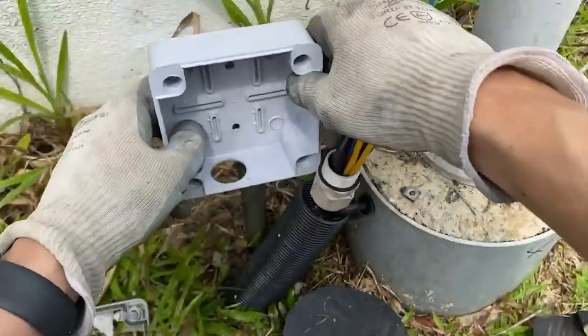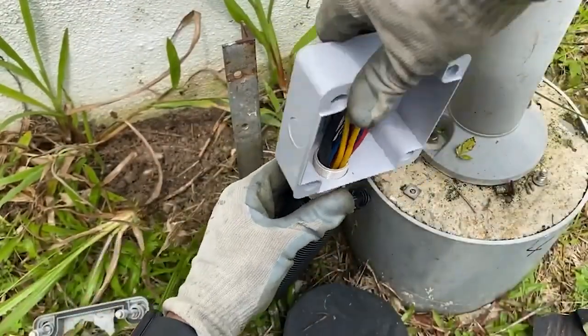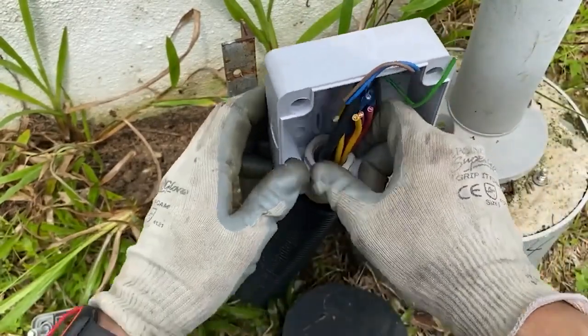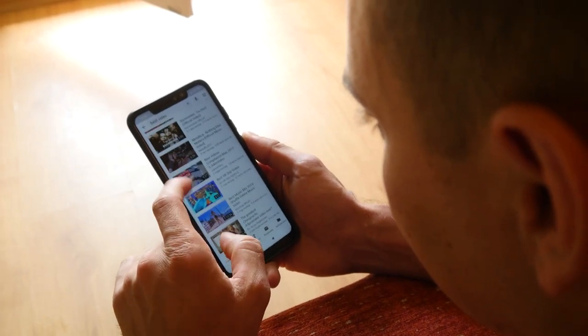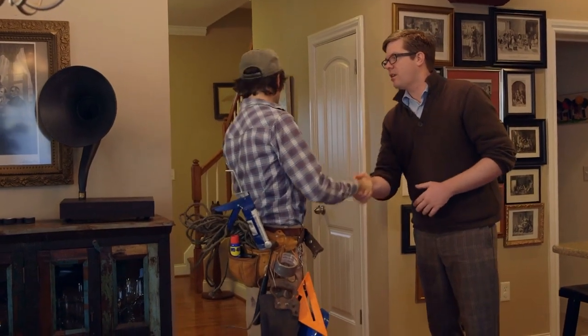What's the solution? Install a box and rejoin the wires inside it if you see a connection that isn't created in an electrical box. This is a very straightforward task that can be completed at home, and there are internet guides available to assist do-it-yourselfers. If you're unsure, you may wish to hire a professional electrician to complete the task for you.